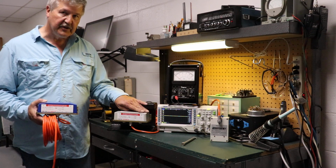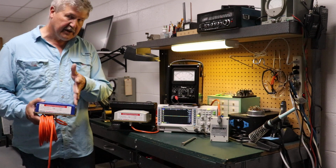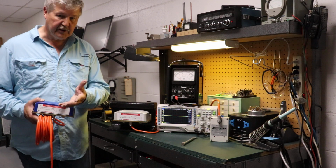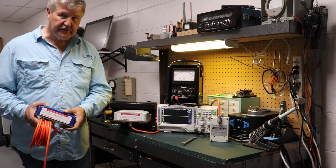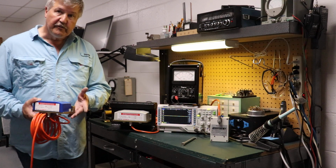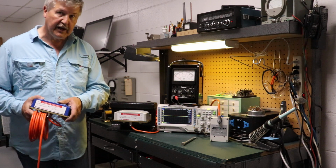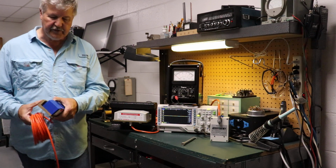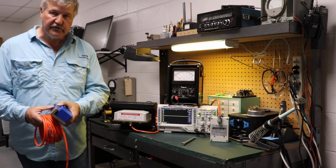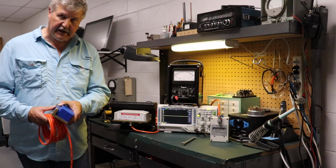These are typically used in non-vital applications. These are typically used in vital applications, for example, grade crossings, interlockers, trap circuits, wayside signaling applications, etc. The appearance is very much the same, and the structure and electrical behavior is very similar. However, there are some critical differences, one of which is that this has two sensors that are always looking at the web of the rail to provide off-rail detection.